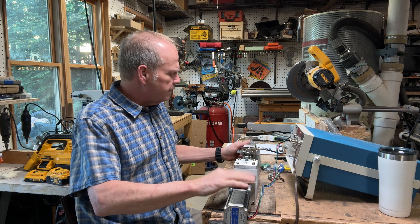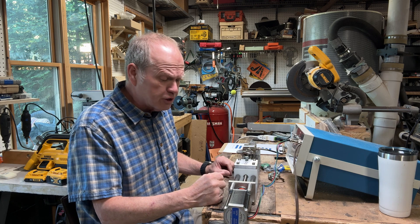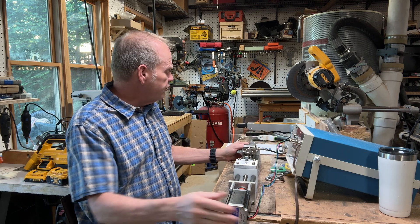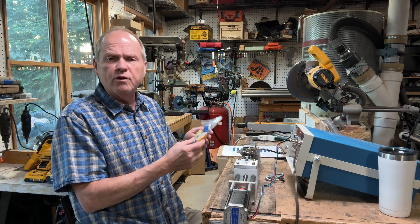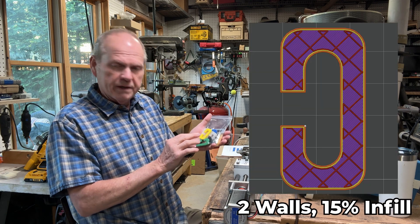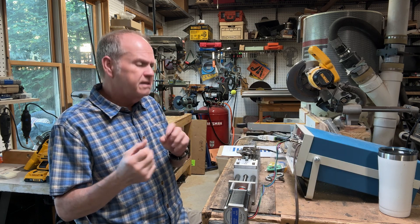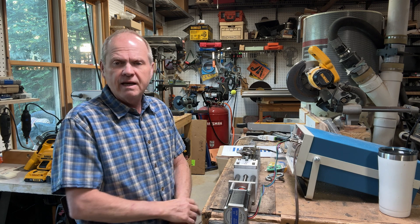We've had a week now with the new Cracker 2, the all-metal higher performance version. We made a lot of additional parts to run back through this unit, and what I wanted to do today is share the results of what we got. All parts were made with the same fundamental settings: two walls and 15% infill, so we could test each part apples to apples and just see the difference in the materials.